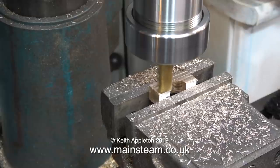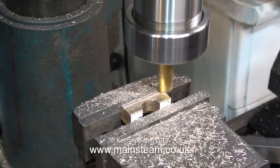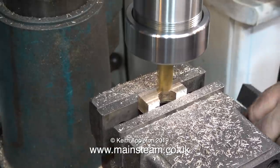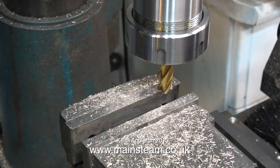They're also useful for test pieces like this. The milling cutter seems to be milling without event and doesn't seem to be going up inside the collet, but I can't say I'm over-impressed with the finish. I don't know if the collet's still a bit loose or the milling cutter's not right, but it's not a good finish even on very fine cuts. At this point, it's not looking like I want to fit this component to the milling machine. After I've finished voicing over, editing, and uploading this video, I'm going to take this collet chuck back to RDG Tools and instead buy two full sets of R8 collets in imperial and metric sizes. I will use the other ER40 collet chuck that has the spanner slots on my Boxford lathe. That's it for this one — thanks for watching, and I hope you found it useful.